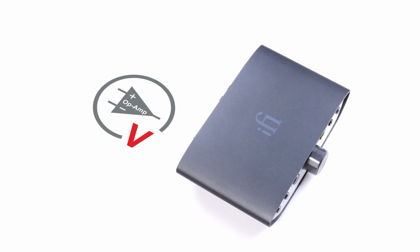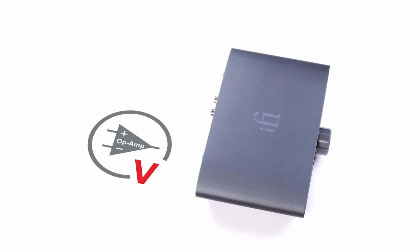Within the circuit of the Zen Can is an operational amp known as an op amp, which is itself an OV series component. These are incredibly high performance, extremely low noise amplification circuits that have a total noise and distortion rating of 0.0001. When you get under 0.005, let alone 3 zeros, distortion is virtually completely inaudible to humans. This is also built using Class 1 ceramic capacitors for excellent reliability and longevity, and most importantly to audio, low losses.